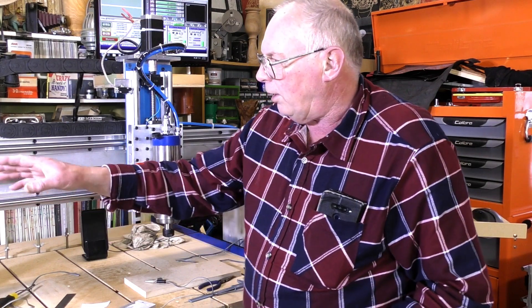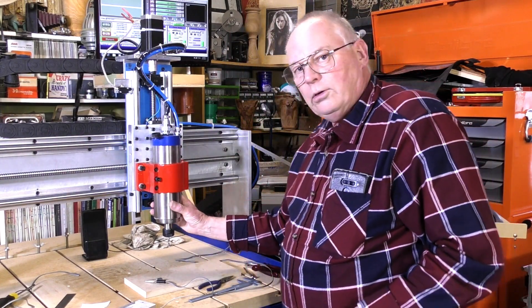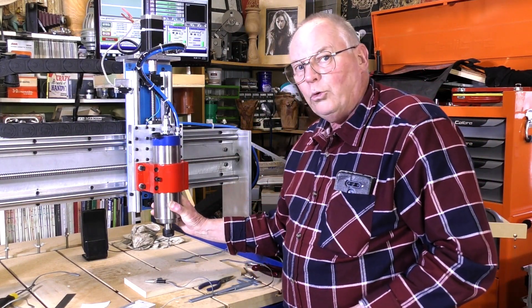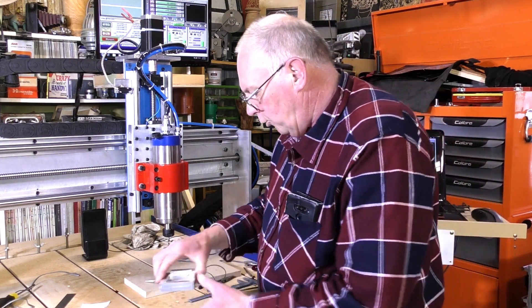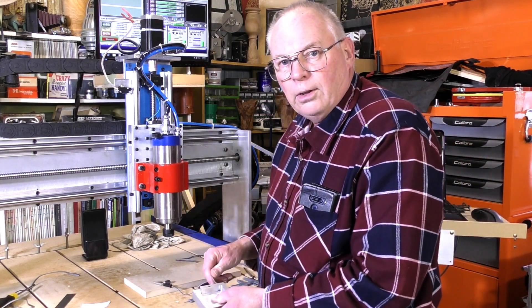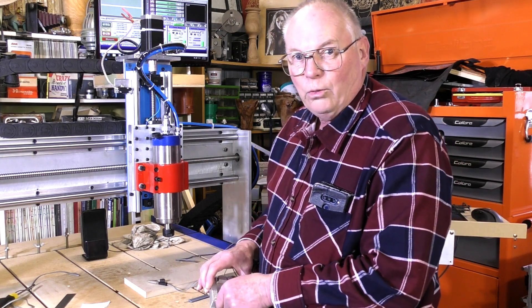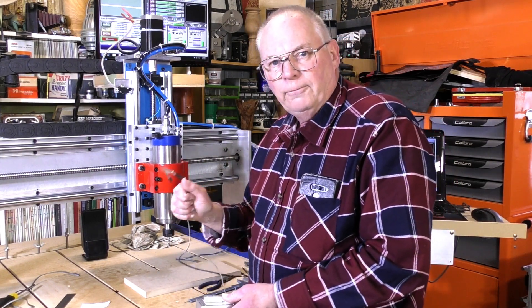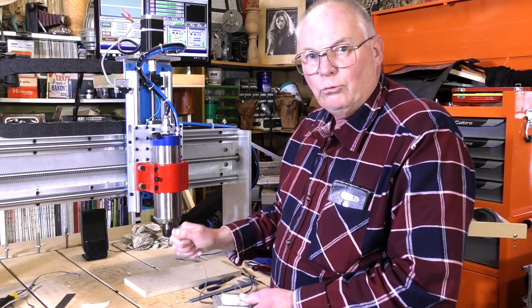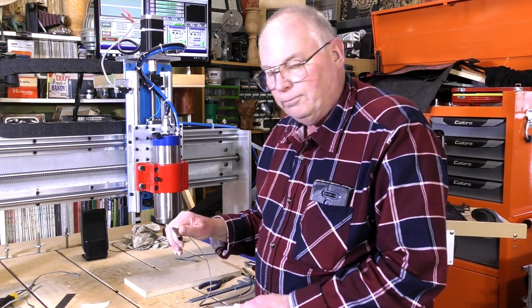When I say the ground of the machine - this crocodile clip, which is the blue and grey lead, which is the common ground, is actually connected to the ground of the machine, directly coupled up into the electronics. It's the same ground as the limit switches as well. So all the grounds are all interlinked - whether it be the drivers for the stepper motors, the limit switches, or even the spindle. It's all the same ground, earth. So if you mix these wires up, it just won't work. It's important to get your ground feed in the right place.